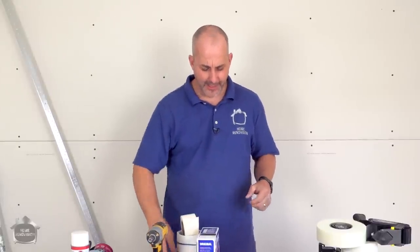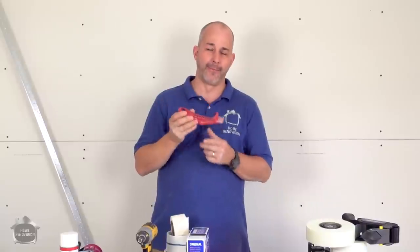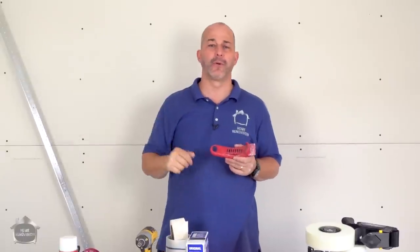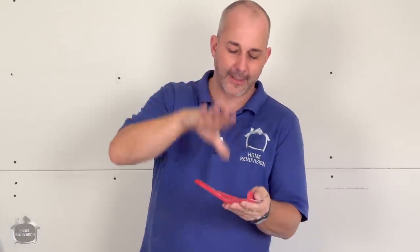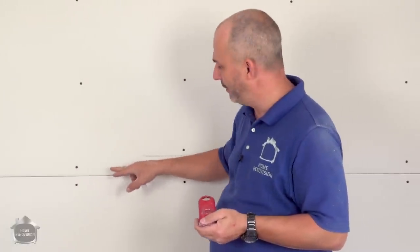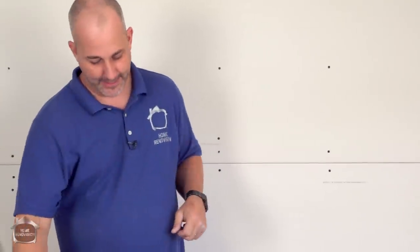Now that we have our drywall installed, I suggest some kind of foot pedal. When doing drywall, you put the ceiling sheets on first, then hang the second sheet snug against the ceiling, then put the bottom sheet on. In most places the bottom sheet has a bit of a gap, so you put this foot pedal underneath and step on it to lift the sheet up nice and snug. That tight joint makes finishing much easier. It also acts as a rasp to clean up your edges — a handy tool for about five bucks.